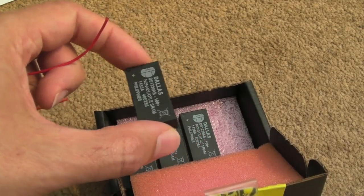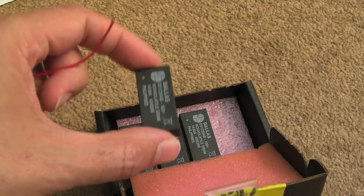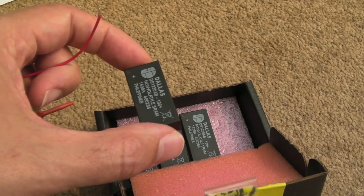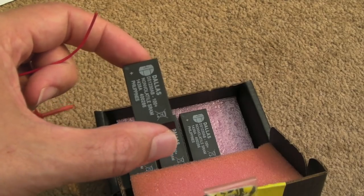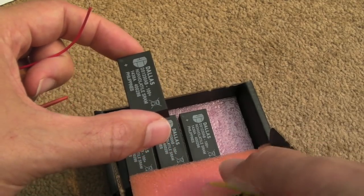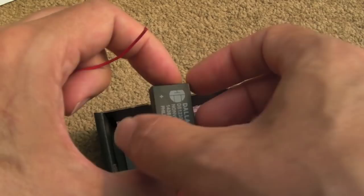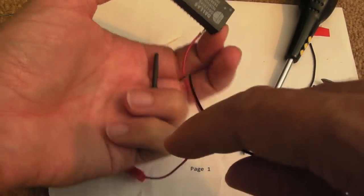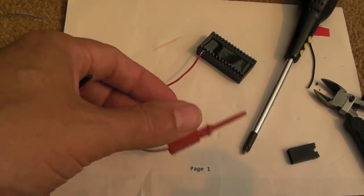Exile is one of those games that should auto-detect RAM, so we could try that. Also Astro Blaster, which I want to use with the speech chip when that arrives — I've got a speech chip here but it's a faulty one, so when the working ones arrive, hopefully we'll have in-game speech. So the write enable is coming out here to the existing clip I already had ready.